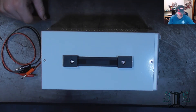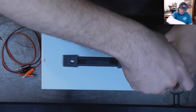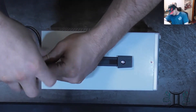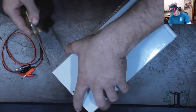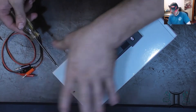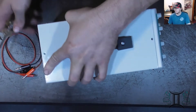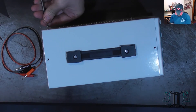I'm actually kind of curious. Let's go ahead and tear this thing open real quick and take a look inside of it. I want to see what kind of build quality we're dealing with, because I have seen reports of these things catching on fire. In that case, I'm going to go through and do some modifications to this. I'm going to put a circuit breaker in it, because looking at it, I don't see anywhere where there's any kind of circuit protection on the outside. And usually for something like this, they'll have the circuit protection on the outside.